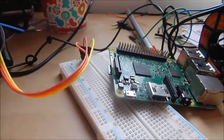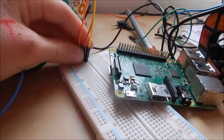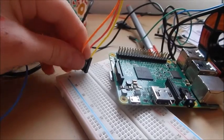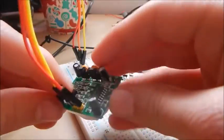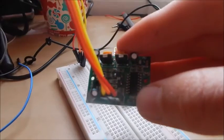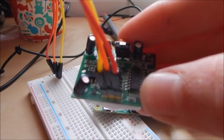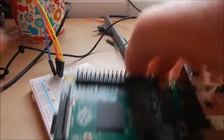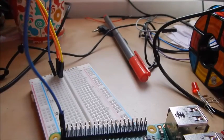What you'll need to do is put your PIR sensor on a breadboard, making sure the pins are definitely the right way around — which I have drastically failed at, but they are now correct. You can kind of see on here it says VCC, it says OUT, and it says GND. This VCC pin needs to go to five volts, so go to your Raspberry Pi board — this one here is five volts.